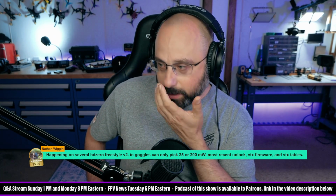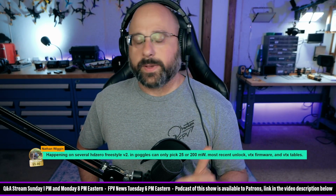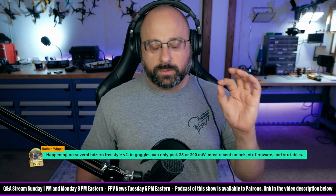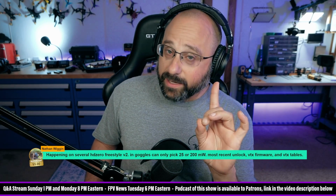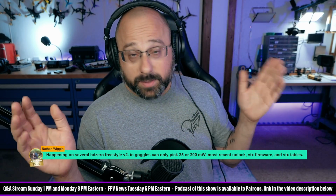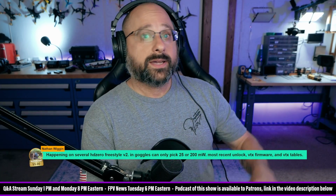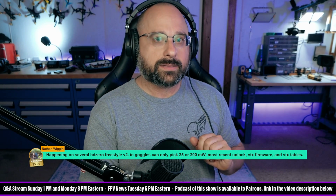I don't think you unlocked it, with all due respect. When you do the unlock procedure on the HDZero Freestyle V2, you have to flash the unlock firmware, then you have to unplug the programmer, because if the programmer is plugged in, the VTX won't power up. You unplug the programmer, you power up, and the blue LED goes blink, blink, blink. And at that point, it's unlocked.